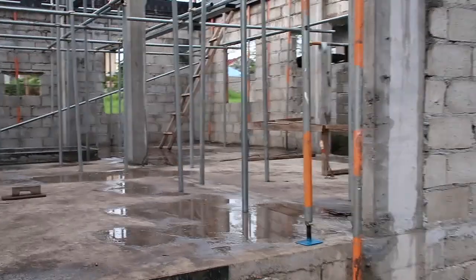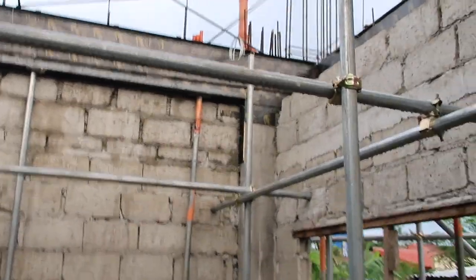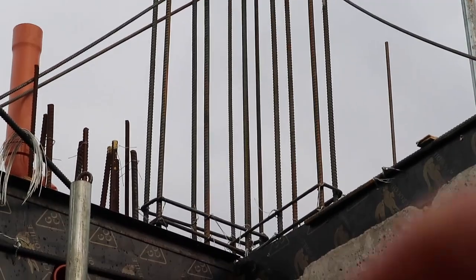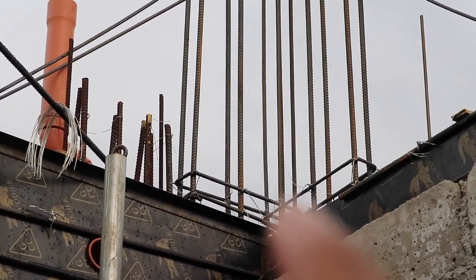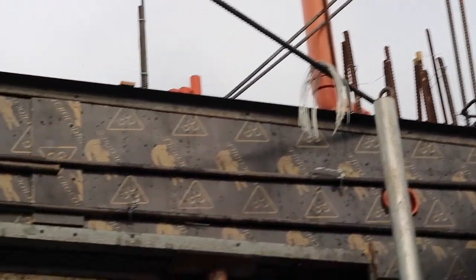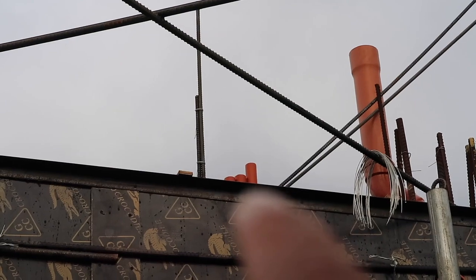I think they've watered down already the inside of the house because it's all wet. The good news is they are ready to pour tomorrow, and that's what my husband has been waiting for — everything is all good, they're all done. Okay, I just wanted to get clear about this 90-degree column: we are using 3 of the 12mm — right there in the middle, there's three — and then 8 of the 16mm. And on the other side, you see the pipe — there's three; I think it's three-quarter size — that is going to be our water line.